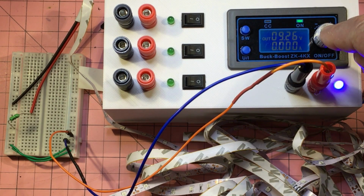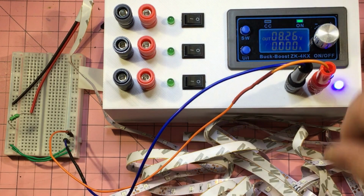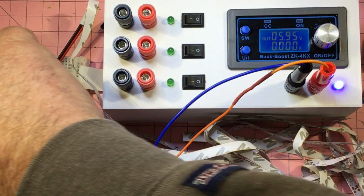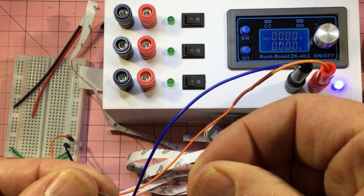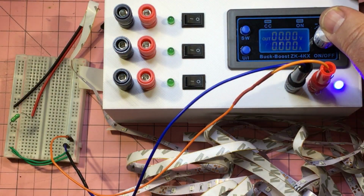Let's put another one in there because, you know, why not? I'll just wind that voltage down again. So let's go 8 volts. Is it warm? Nope, not warm. I wonder if it's a resettable fuse. Nope, it's blown, baby. Okay, out you go. And we'll throw in another one. Thanks for playing. 125 milliamps, just check that on the side. 125, I don't know if you can see that, but I can see that. All right, so let's make a circuit with it. All good. Okay.